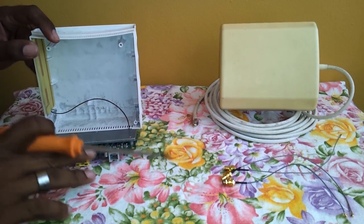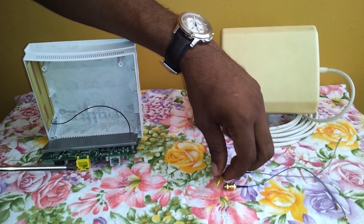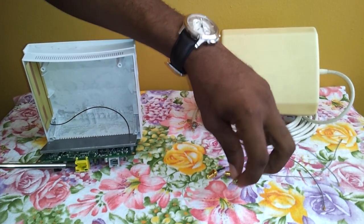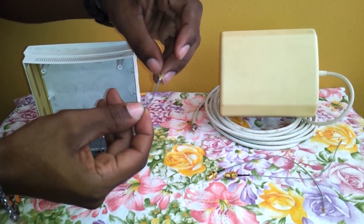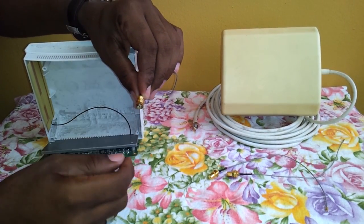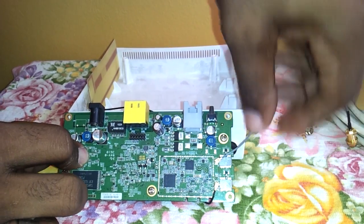To modify our modem, we're going to need an external WiMAX antenna, and we're going to need coaxial connectors. These are U.FL to reverse polarity SMA connectors. We're going to simply plug the U.FL end back to the circuit board, and then we're going to have this section on the back of the device — we're simply going to just plug this end to the circuit board.